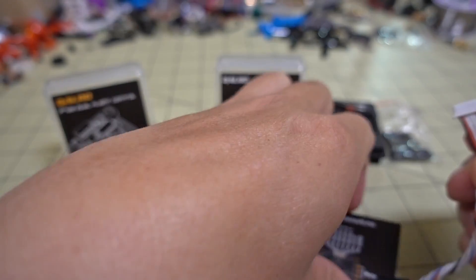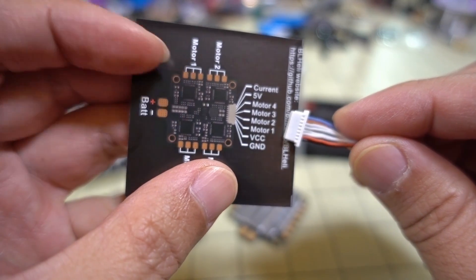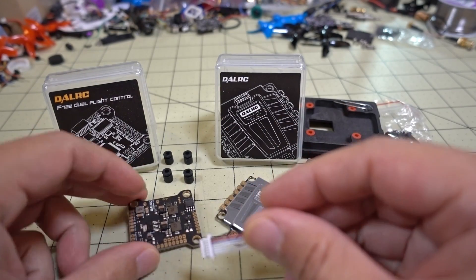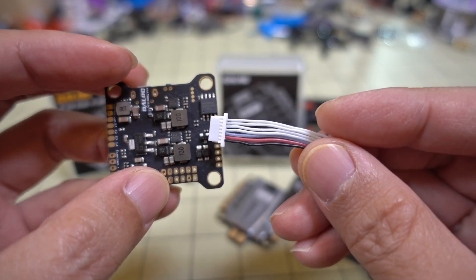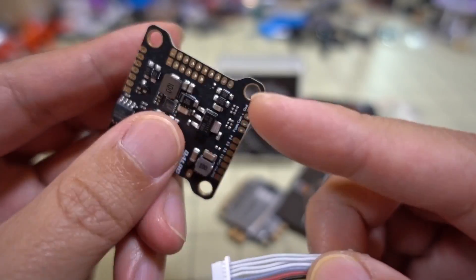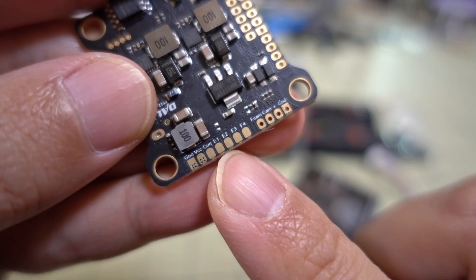The documentation shows the order of the wires on the wiring loom. The blue wire on top is your current sensor wire, the orange is 5 volts — there's a 5V BEC in here — the white wires are the motor outputs, red is battery voltage, and black is ground. The pinouts on the F722 flight controller are a bit different. Looking at the pads on the FC, it shows ground, VCC, current, and then motors one, two, three, and four.